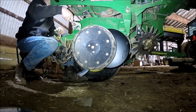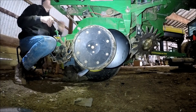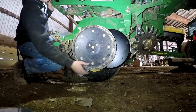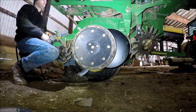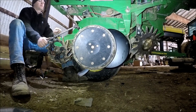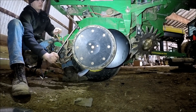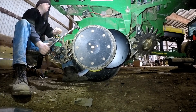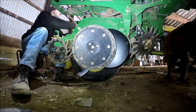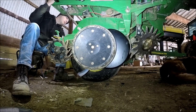Looks like I'm adjusting it just a little bit more. I'm making about a quarter to half inch turn adjustments, because it wants to spin all but on one little part of it — and it's not like it won't spin around, but I don't want it obstructing the seed disc opener. I must be happy with it because we're at the end of the video.